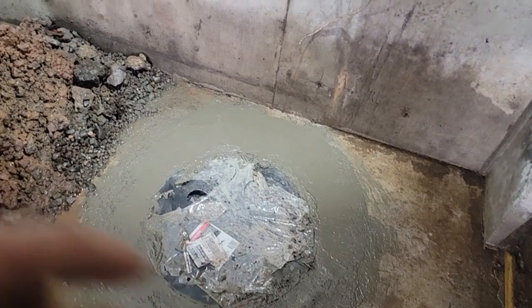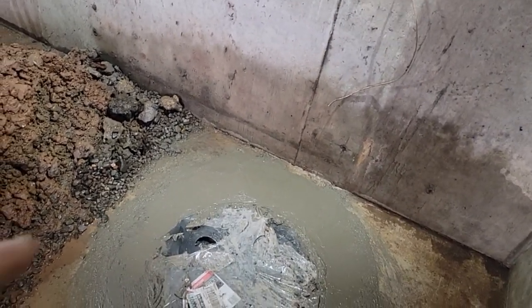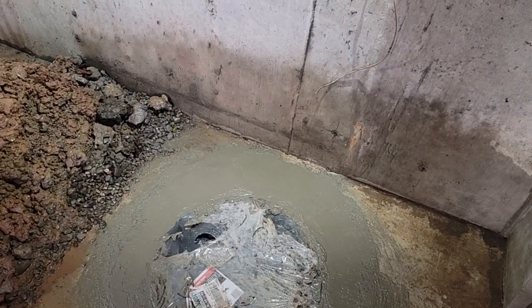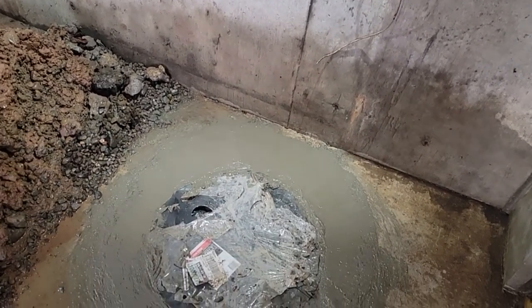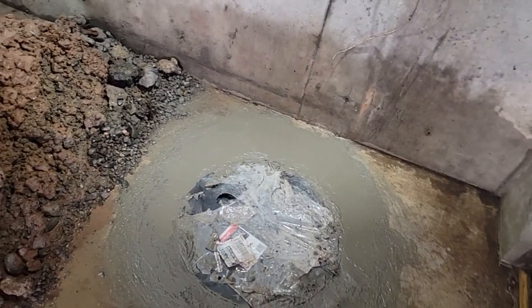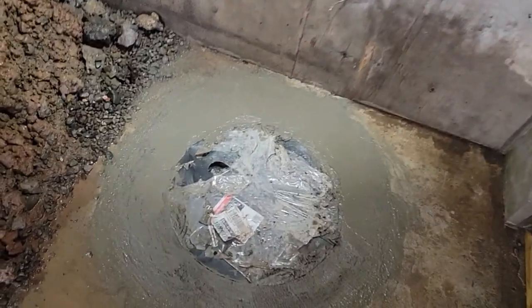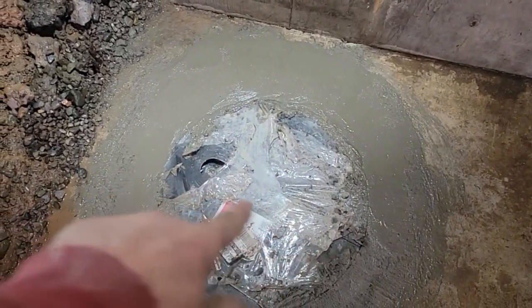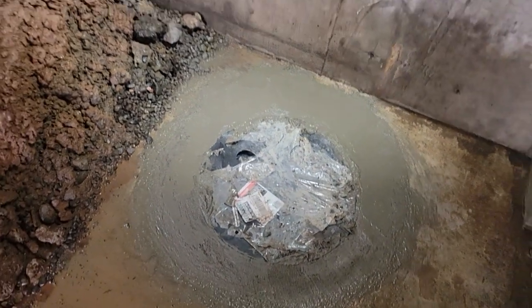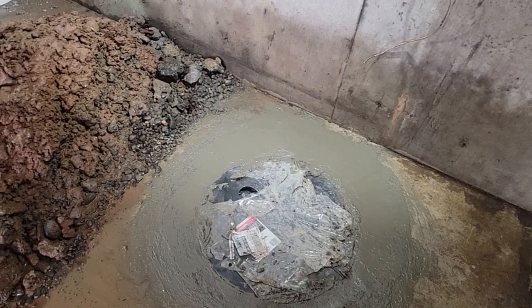I'm gonna let that dry out. Maybe slake is a word. Dry out a little bit, and then I'll get my little brush and give it a nice little finish around there. Make sure it's flush with the floor or a slight dip so that we can just squeegee the water right into it. This top has slits and holes in it that we can pop out, and any excess water can get down in there, but you don't fall into the basin.